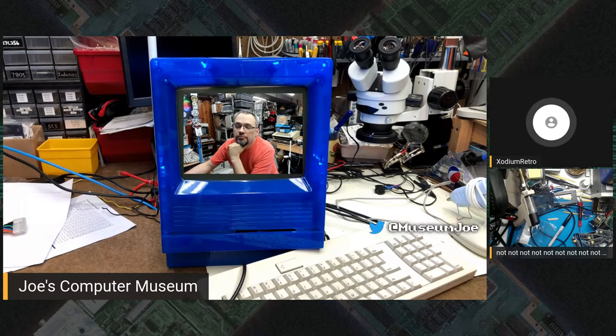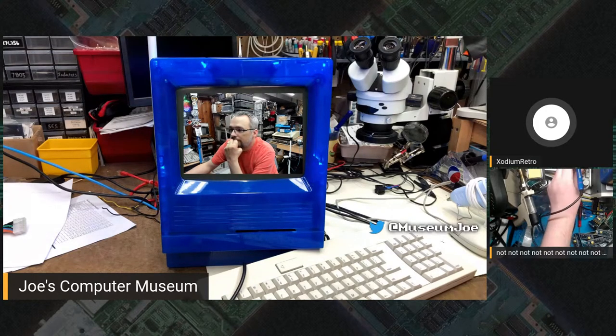There's a very narrow sliver of Macs where a ZuluSCSI would be more beneficial than a BlueSCSI, because at the top end of the Power Macs you might as well just buy a SATA card. That's the transitionary period where they started to move to IDE anyway, and then you'd have an industrial flash card or something. So the narrow sliver is the NuBus Power Macs. Arguably with those, everything is so slow you could go either way with a BlueSCSI or a ZuluSCSI, or land somewhere in the middle with an F4 BlueSCSI, and it's still cheaper.